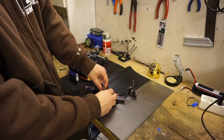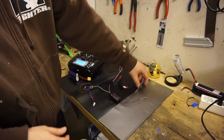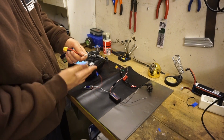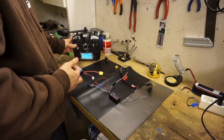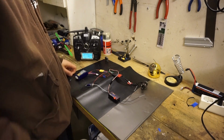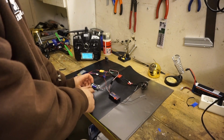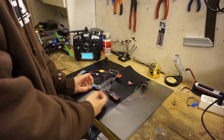And then you connect, I have a motor and an ESC. So connect the ESC to the other end of the servo lead loom, and then power the alarm via something. I just added the balance plug here so I can power it from a 3S battery, and then I just power on the ESC. There we go. So first off, you have to remember to power on this thing, otherwise it won't do anything. So the single button on it, press it, there you go.